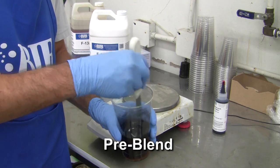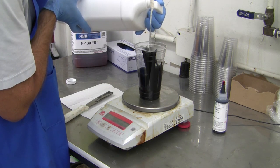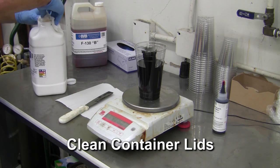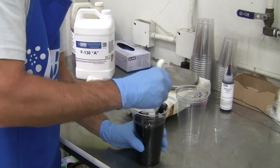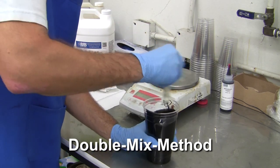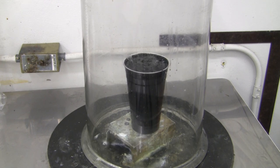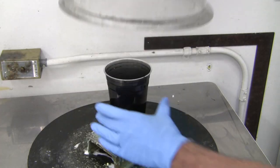Once the additives are in, we pre-blend before adding the appropriate amount of A side. This saves time versus trying to mix four different ingredients all at once and decreasing your work time. Note: we often clean the container lids after pouring to prevent sticky messes or stuck lids later down the road. Once you've measured out the A side, begin to mix vigorously and thoroughly. Again, we opt for the double mix method to reduce any chances of unmixed material ending up in our cast part. The mixture is then placed in our vacuum chamber. As mentioned in our first video, vacuum removes the air bubbles, and pressure casting is not effective for flexible materials such as this, so vacuum is more practical to use when casting a variety of materials.